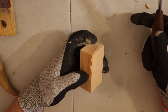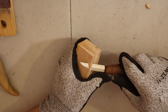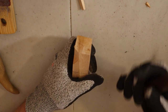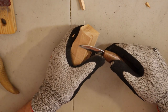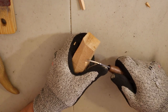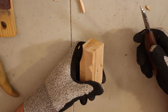Next is the sweeping cut: you carve in a sweeping motion, going in deep and then rotating your blade up with your wrist — that makes a nice scoop shape. Then there's the V cut, one of the most used cuts. You take your knife at a 45-degree angle and carve in, then go to the other side with another 45-degree angle, and remove the wood. That gives you a clean V groove. The V cut is used really often for many different things.